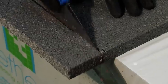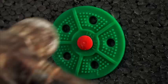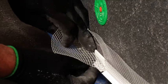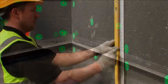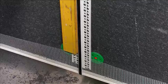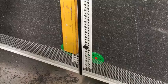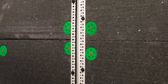Where window openings allow, to prevent cold bridging, a thinner insulation board can be used on window and door reveals and rendered to match the walls. Once all of the insulation boards are installed into the base track, the 37400 clip should be attached to the base rail. Install render surface beads where required, using fir tree fixings, and install any movement joints at agreed locations. When replicating structural movement joints, a minimum 6mm gap should be left between the insulation boards. The movement joint should then be installed directly in line.